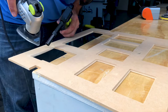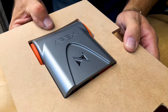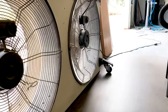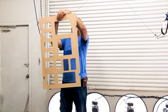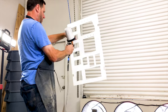Once the board was cut, it was sanded several times until it was super smooth. You can see that the apex fit perfectly in place. When I first contacted Robert, I was planning to have him cut the front panel and then paint it and make the cabinet myself. But after seeing all his equipment and seeing how detailed he was, I knew it would probably turn out better if he painted it. He ended up using white semi-gloss lacquer, which helped prevent the panel from feeling sticky. The first coat he put on was a primer — this makes all the excess wood particles stiffen, allowing us to sand it more and making the panel even smoother.